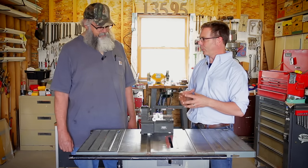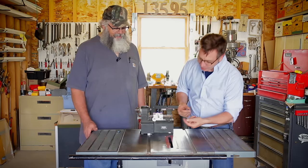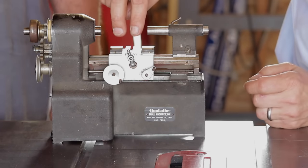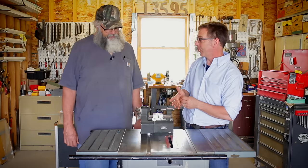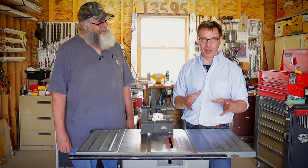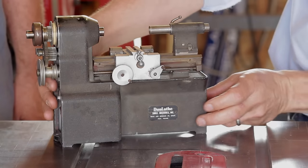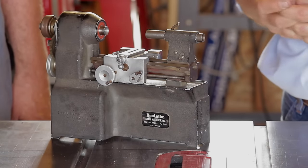All the gearing, and you told me that change gears were available for the lead. And it's fantastic because there's actually a small rack here, so we have a half nut. There's a cross feed, and it also has a compound. No, they didn't come with a compound. Just the two. Now, was the crossfeed ever powered? No. I know I'm asking a lot, but it's just such a great machine, and I've never seen one before, so now I'm going to have to start hunting for one.